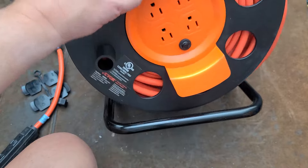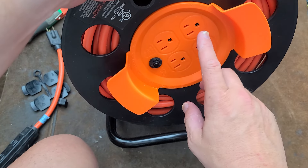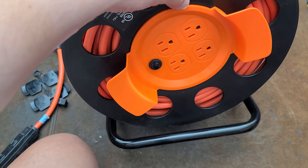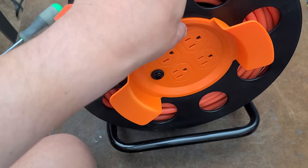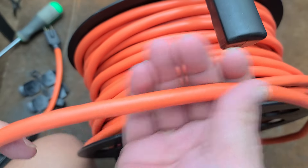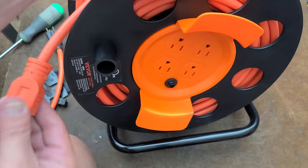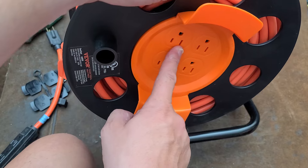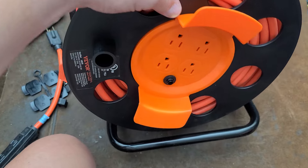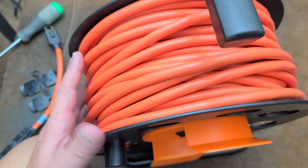That's a little bit of a disappointment, because for something that really could be useful, this really does a number. Part of the problem with loose plugs is that connection has a lot of heat. Most fires associated with extension cords and power strips happen at terminations — it's pretty rare for a wire to just burn up somewhere randomly along the length. It's always where it's terminated. So you really need tight-fitting connectors to reduce heat buildup right at the plugs. They're going to get loose, creating a ton of resistance, which means a ton of heat building up right at the plug. So it is kind of a safety issue.